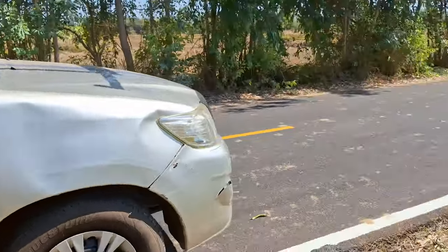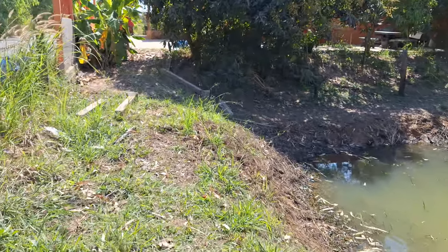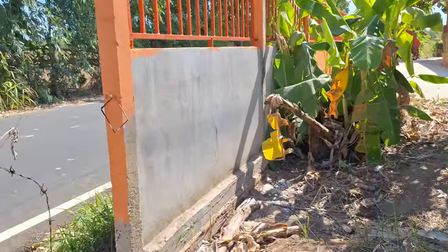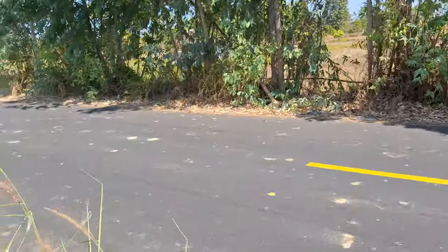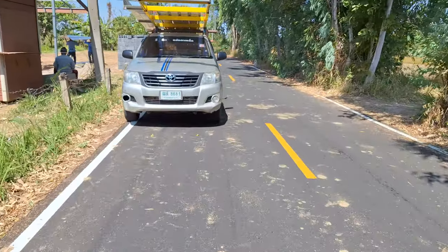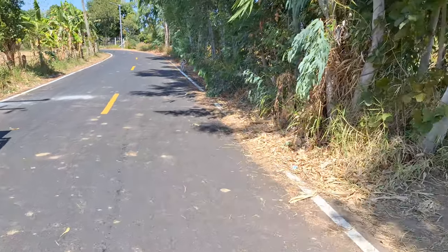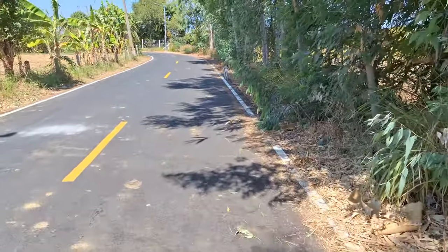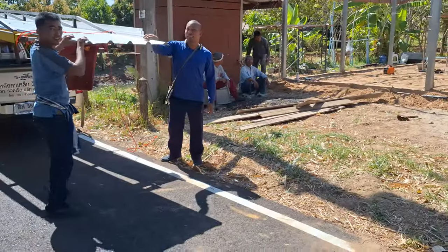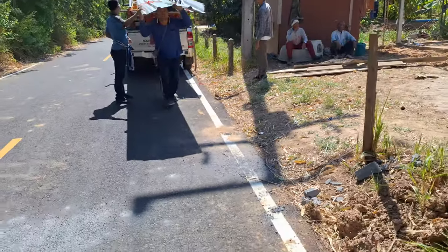Metal shop, they're predominantly all roof sheeting. They have all their sheet metal on rolls, and when you order it, they've got a long bed rolling machine that actually rolls the profile into it from a flat sheet. It's not really corrugated, but semi that way, isn't it? Which gives it strength. The old corrugated sheeting wasn't a continuous wave, but for quite a few decades now, that's been less the norm. Predominantly, I think we all know the profile we're talking about, which is about a 6-inch flat with a ridge, and then another 6-inch flat, and that's what we have nowadays.